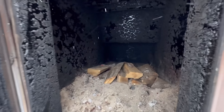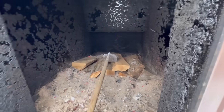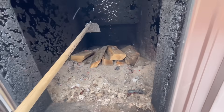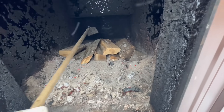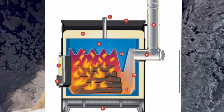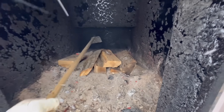I'm trying to stay back a little bit from the very back of the stove because there's a baffle plate — the smoke and heat rolls up underneath that and then goes straight up into the chimney. So if I put my wood all the way back there, a lot of that heat is just going to go straight up and out.